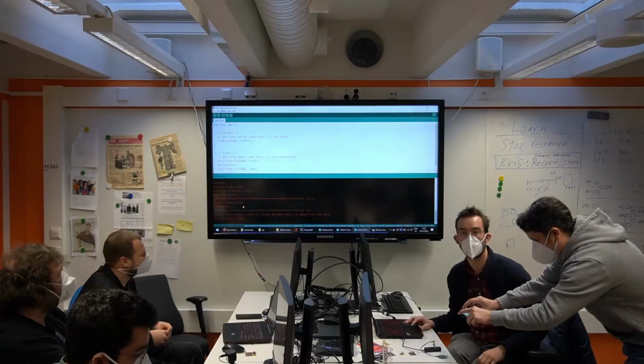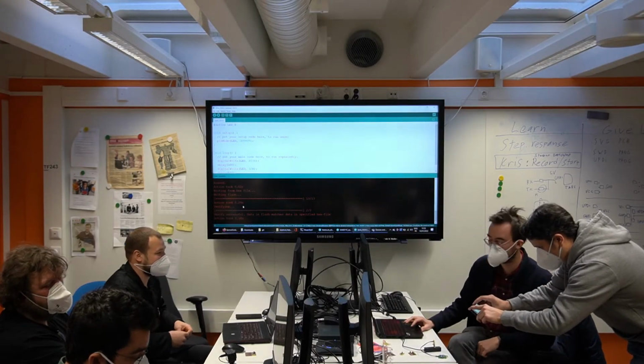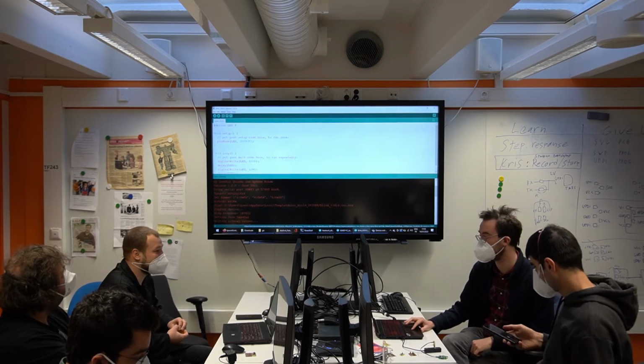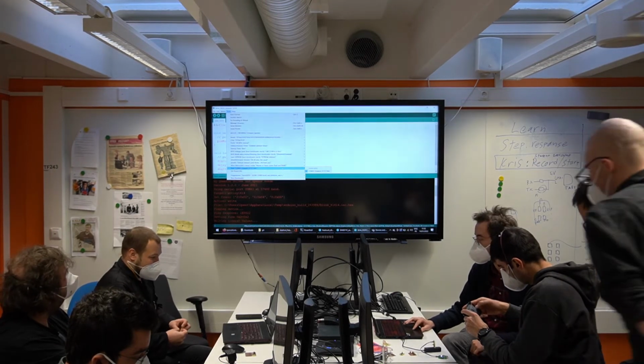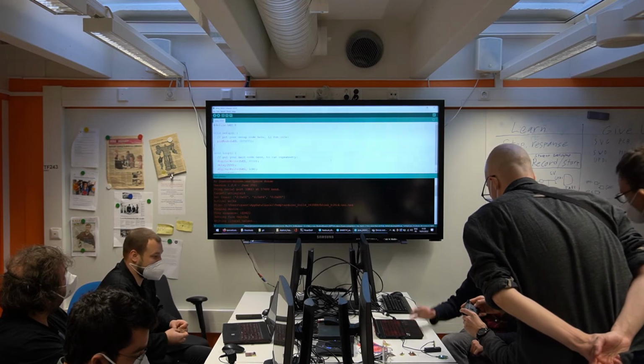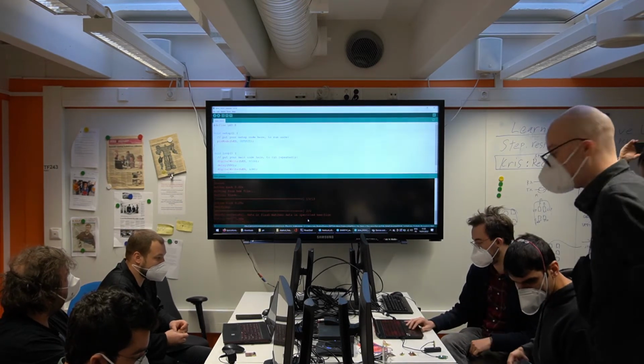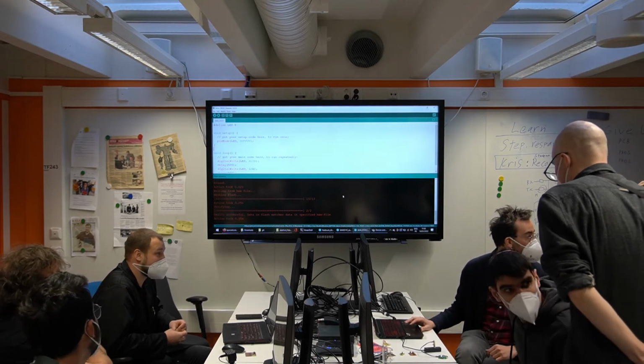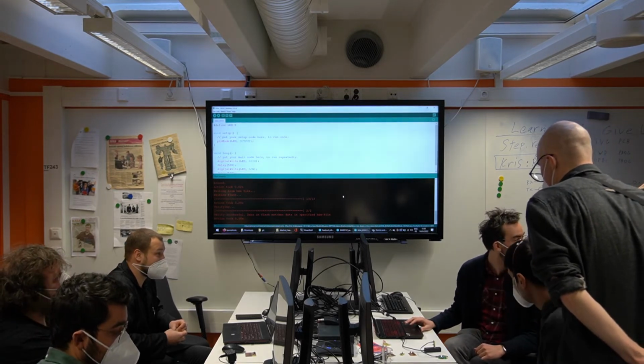And then I got this little code that sends the data. It blinks. It's alive. But that was quite simple, wasn't it? I mean, in the end, when you want to program a chip, just select the port, serial UPDI, you're good to go. I do have to say that so far this is the best reason I have ever seen to use Arduino IDE.